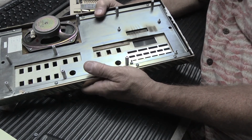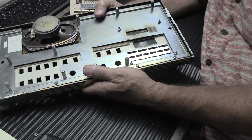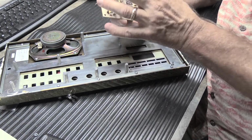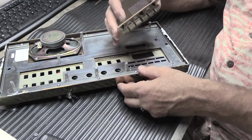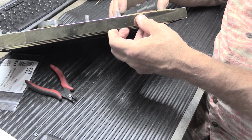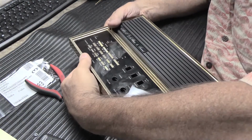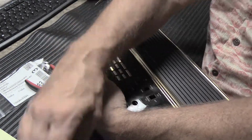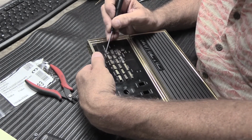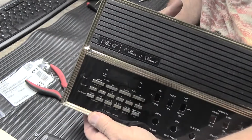It could be a little bit challenging, but if the challenge is deal with spinning buttons or not fix your intercom, I think you can deal with spinning buttons. So because this is nicely designed, if you get them all reasonably close and you lean it upside down like this, see, they don't want to really fall off, you probably can get most of them pretty close like it is here. And then you take a little screwdriver, and the ones that are kind of leaning one way or the other, so they're not lined up properly, you just sort of jiggle them around with the end of the screwdriver a little bit, and voila, they pop through.